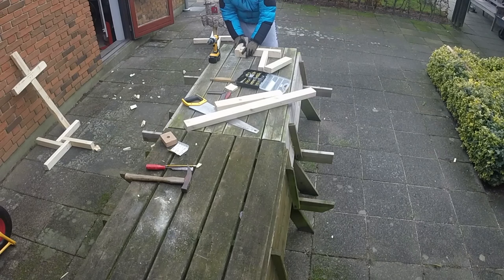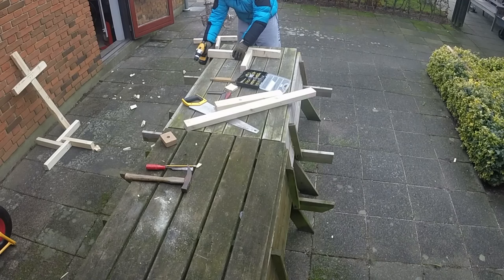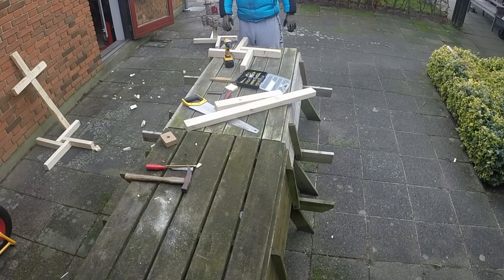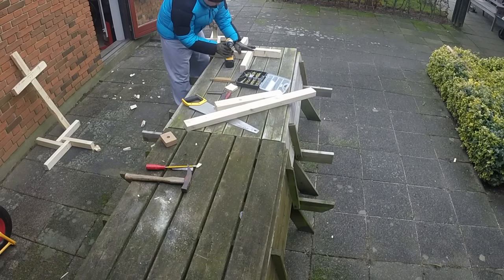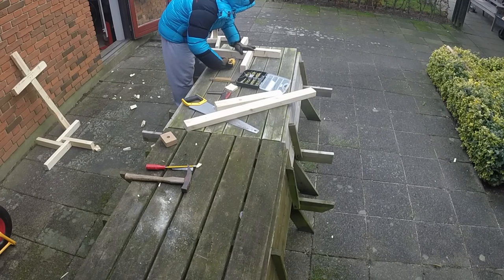Just so you know it won't get too tight or too wide from each other — definitely do that, it's really helpful. First you'll see me drilling some holes in the sides so it will be easier to put in the screws. The screws I have in my mouth when I'm ready to screw them in — this is because when you get some spit on them they drive in way better. Something my dad told me, taught by his dad. It works really well. I just put two screws in each plank making the base.